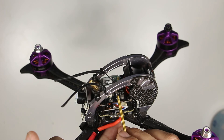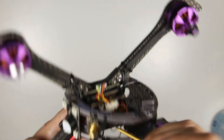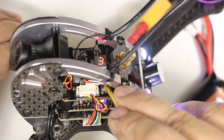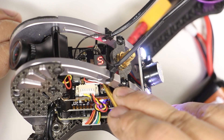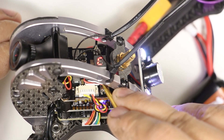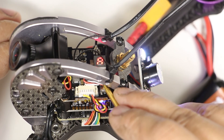The generic 40-channel 5.8 gigahertz video transmitter is a stack-mounted unit. It has a LED and a button to change channel, band, and power. To change a channel, press the button slowly. To change the band, double tap the button and the band letters will be displayed, then tap slowly afterwards to change the letter. After a few seconds it will go back to displaying the channel and band.